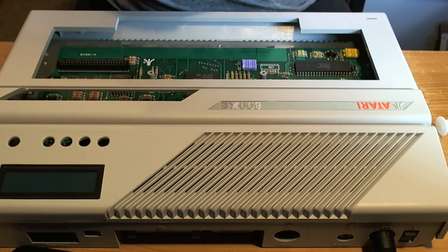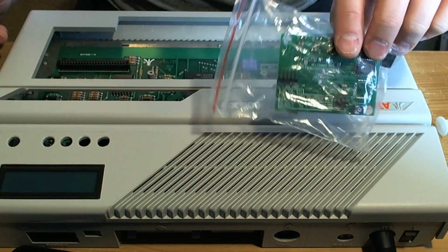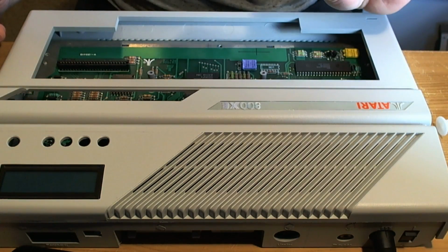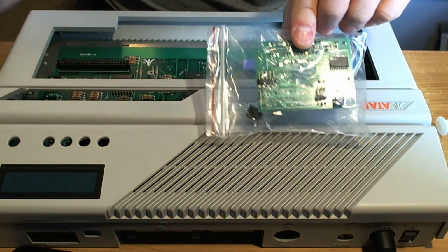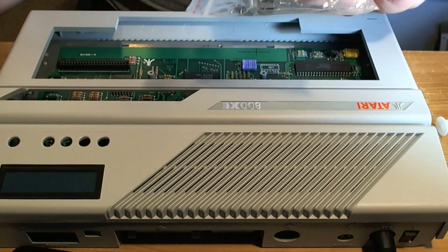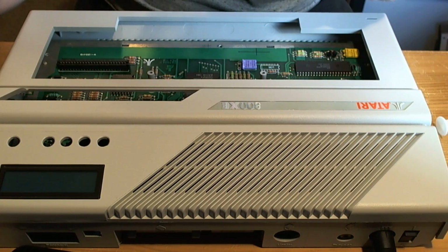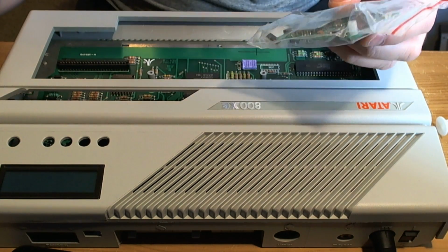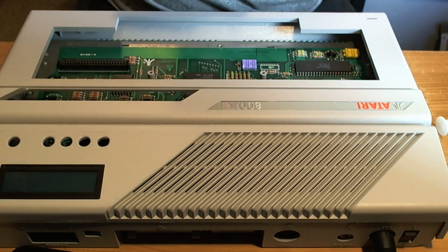Now, who made this one? Panos. Ah, yes. Santos P. So this has been cannibalized because I've taken everything off it when I was testing the hot air station yesterday. But it's broken anyway, because what I was going to do with this was connect a bigger LCD. This was going to be part of a machine, but I destroyed the LCD connector when I took the flex ribbon cable connector off, and I've never fixed it, so it's dead. So I stole the crystal from this board to put in the other one that I made.